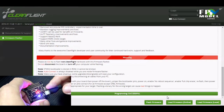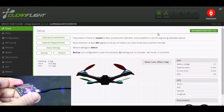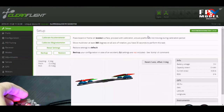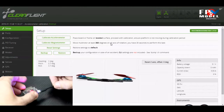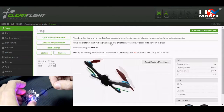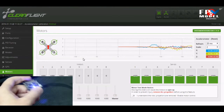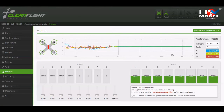Click 'Connect' and it opens up into Cleanflight, which starts reading the board. Let's calibrate the accelerometer: lay the board down on a flat, level surface, keep it steady, and click 'Calibrate.' Calibration is already finished. Now you can see it's reading the board. Go over to the Motors tab to make sure we're getting proper readouts — that looks good. Hold it flat and steady and you can see the accelerometer is registering correctly.